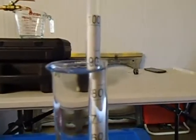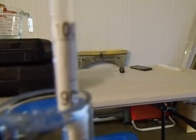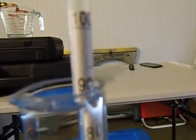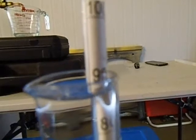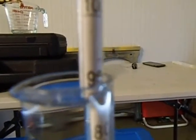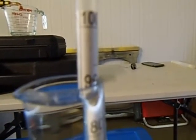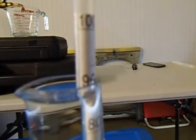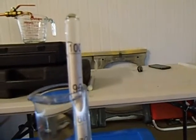I want to take a measurement of the ABV of the first litre that came out of the 600mm column. There is definitely a slight difference with a different length of column — you get a higher ABV with the 800mm column compared to the 600mm. Here I only got 90% ABV compared to about 94–95% with the other one. So it's about a 4% difference — you get a higher yield with a column that is slightly longer.